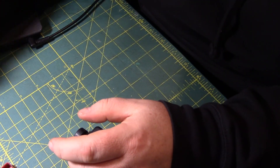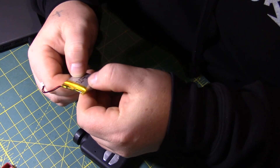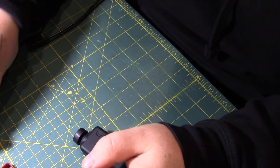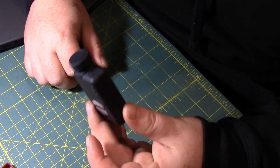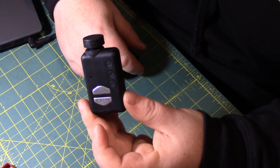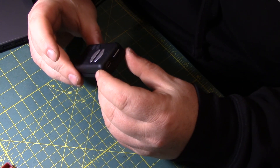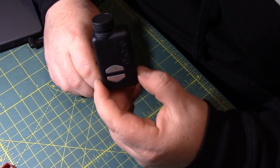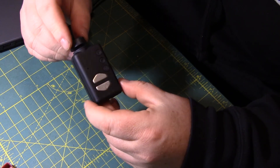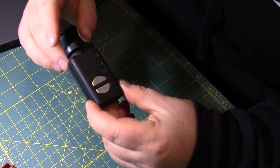I haven't used it on anything yet. You can tell that this battery is pretty much toast. So anyways guys, just a quick modification to the Mobius — if you're running it off constant 5 volts like I am, you're basically gonna kill your battery over time. I started doing the constant 5 volts last year, and I might have had five, six flights total between the Twin and the Skywalker.